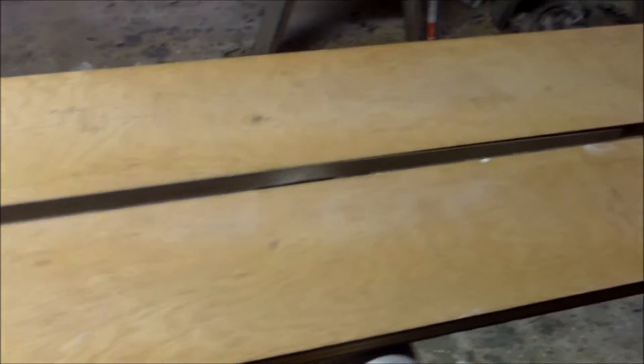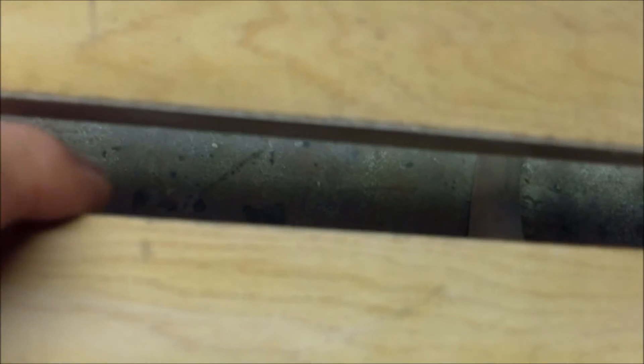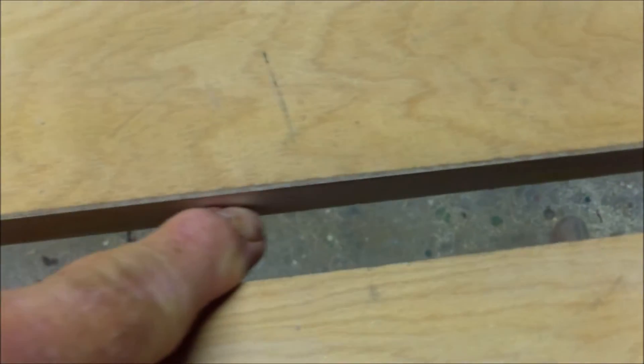To start out, what you need is a guide board. I cut this board 15 inches wide by 65 inches long. I cut roughly a 1 inch slot — it isn't that important how wide, but roughly a 1 inch slot. And then what I did was, on the one edge I Formica'd it — glued a piece of Formica down there. This is just two cuts on the table saw, then glue down that piece of Formica. This gives me my straight edge and my guide for cutting Formica and other materials.